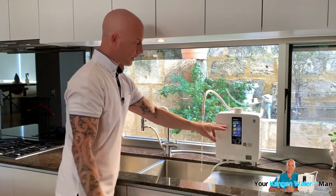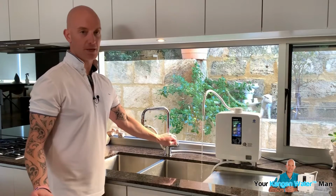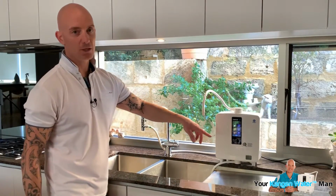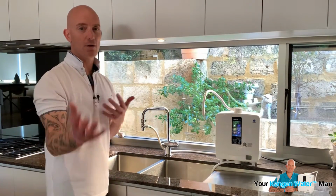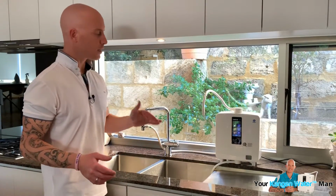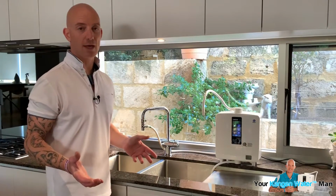And if this is a brand new unit for you, which it obviously is because we're doing this video on it, you're going to put the water on clean and leave it running for 2 minutes. That's going to flush out any buildup that may have been in the unit, because they test all the units first, as well as get any air blockages out of the filter. So run it for about 2 to 3 minutes, then it's all good to go. So that's basically the install of the K8.